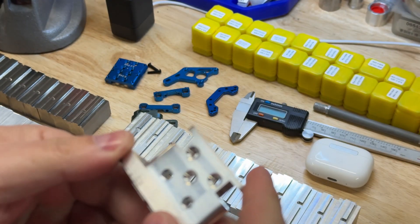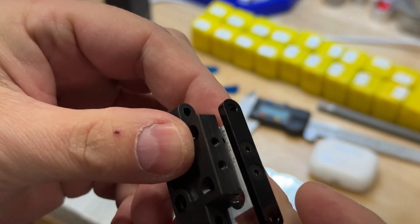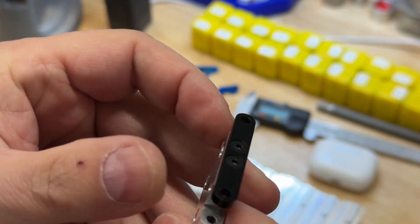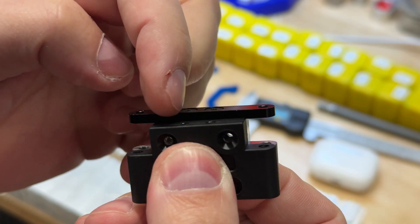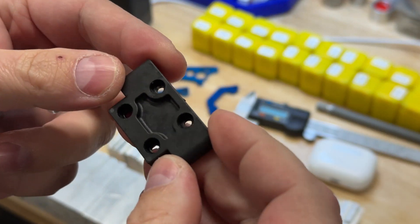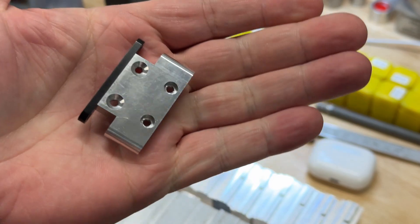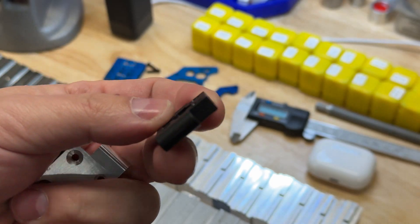This actually replaced this plastic piece, which had a little black bar bolted onto the front of it, kind of like what this aluminum one does. The idea was that if the car were to have a collision, with this aluminum bar bolted into the bulkhead it would be less likely to get destroyed. But this breaks pretty easily. The company that makes the car has aftermarket components — not only do they make this piece in aluminum, they also make it with different angled holes because it dramatically changes the way the car handles.